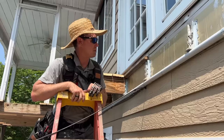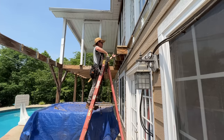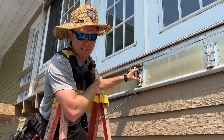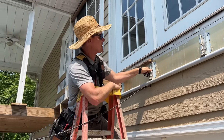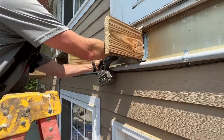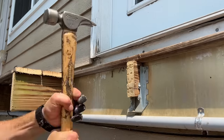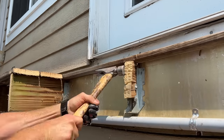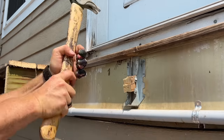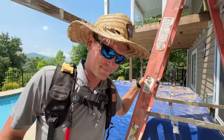We're breaking this deck down little by little. I'm taking this one-foot piece of joist that's remaining and sawing it off about two inches away from the house so I can take the end of my hammer and split it like firewood into a bunch of little pieces, then knock all those out with relative ease. Now I have nails still left in the joist hanger that I need to remove because we're going to reuse this joist hanger. I'm going to go home and get my Dremel - it has a really small cutting disc and I can get in here and cut these nails off. I'll probably have to put some Lexel on these holes where the old nails were. I'm trying to be so careful not to damage this aluminum flashing.